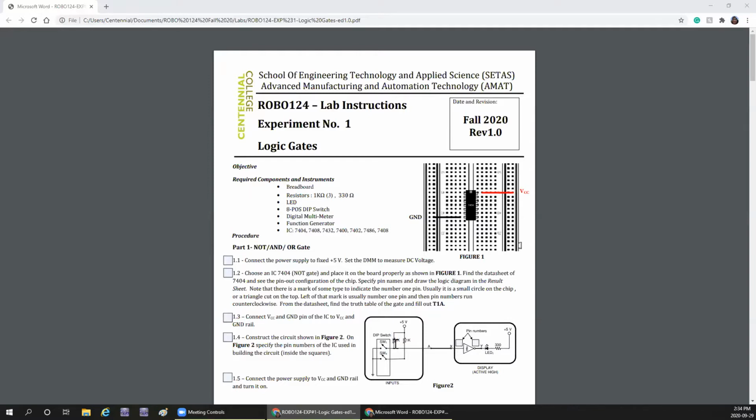So for you, when the switch is open, that corresponds to giving a 0 at the input. Now the LED is on, so it is like a low here, and it is going to produce a high.